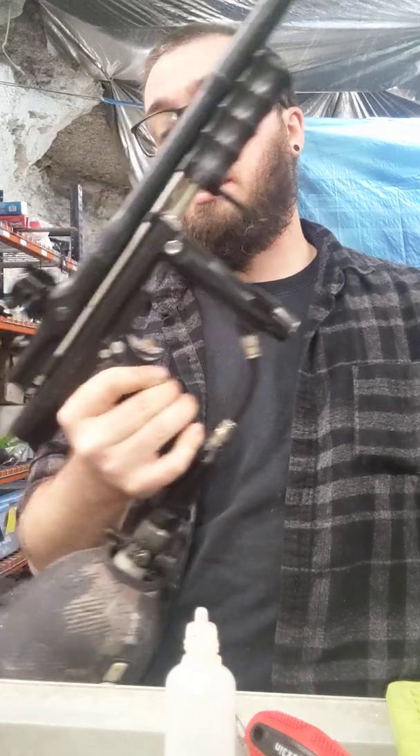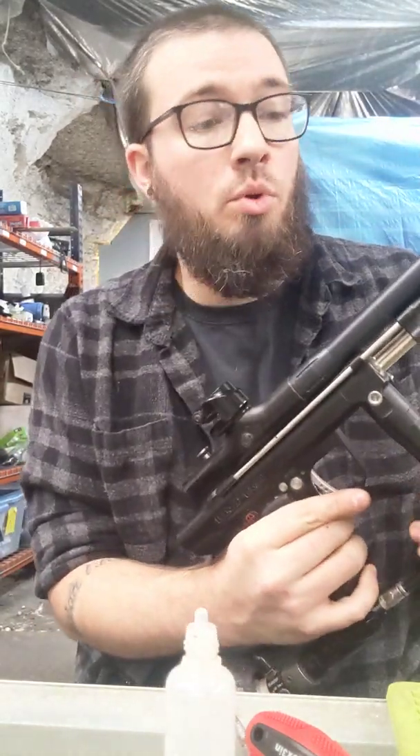And we're good. So this is just one of those ways that whether it's your stuff or an employee's stuff or a friend's — whatever it happens to be — this is something you might look into so you can save yourself a little bit of time, a little bit of money. No parts cost. We just saved the gun without having to replace anything. All it took is literally just a little bit of time, a little bit of sandpaper, a couple drops of oil. Most of the time this is not necessarily going to save you every time — a lot of the times you're going to have to replace the cup seal. I wouldn't doubt that this one, if we put a few rounds through it, that cup seal is probably going to bounce around a little bit and the divots from the debris are probably going to cause a little hairline leak. But for right now she's sealed up — it'll get him going. And if he wants to replace the cup seal, we can go that way. But in the meantime, we've saved the valve without costing ourselves any money.